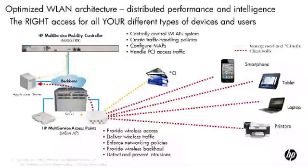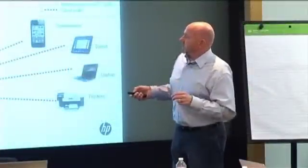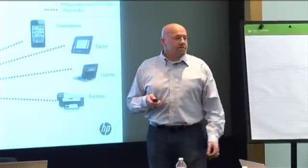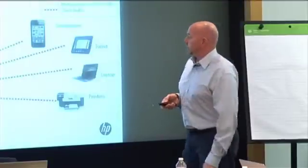Most people have this nowadays, but you really need both of them because you want to separate off your bring your own devices, your enterprise environments, but you also want to, in wireless environments, we have PCI compliance, right? Anybody in retail, HIPAA requirements, Sarbanes-Oxley. So we have to have ways of being able to audit that. So that's the key importance of being able to also tunnel back to the controller so you can maintain those databases and get that required reporting that you need to maintain those certifications.